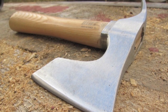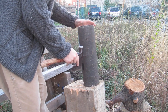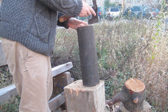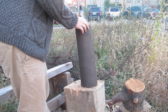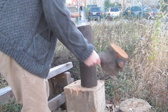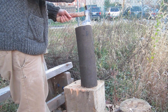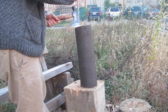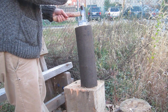The grind that came on it is good — it's a regular axe grind — but I prefer a single bevel like a carving axe, especially for that size, so I don't use it a whole lot. The back of it is actually really nice; I wasn't sure about it but that proved to be kind of useful. As an adze itself it's more of a smaller detail thing, but definitely useful in a lot of areas.